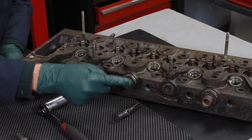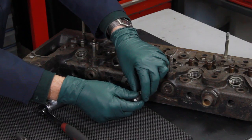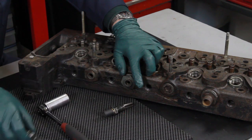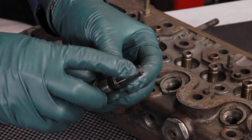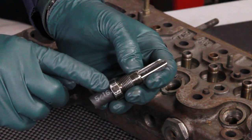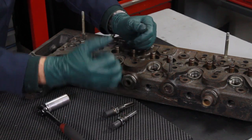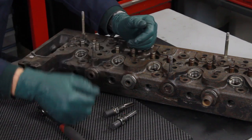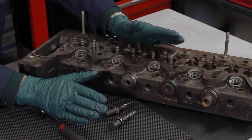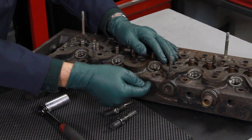So if you're having to put a wrench on it, it means there's some pretty heavy carbon in there and you're going to have to take it easy. If you try to force it — for instance, if you try to hammer it in — you can break one of the flutes on the reamer. Look at this one we got back from a customer. Can you see how that flute was broken off? Looking at the head of this housing, you can see the socket marks, so somebody had inserted this and was probably reefing on it with a big ratchet wrench.